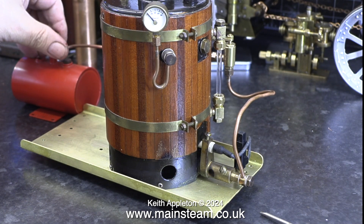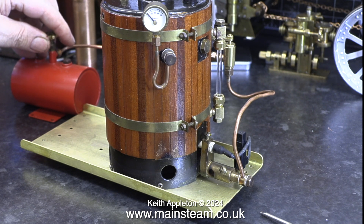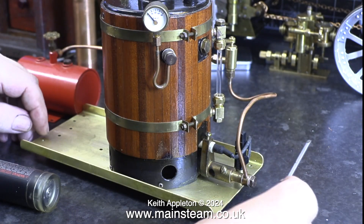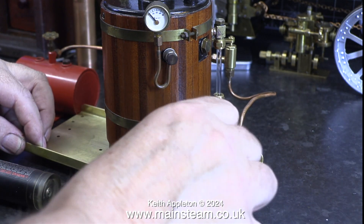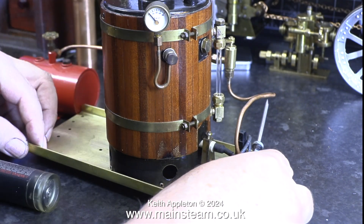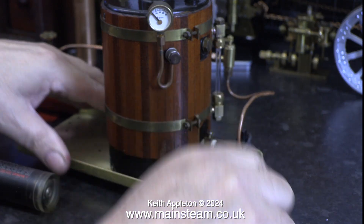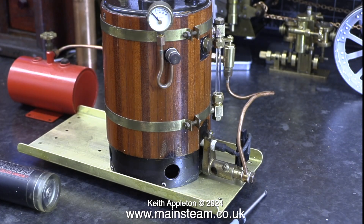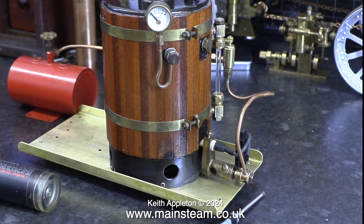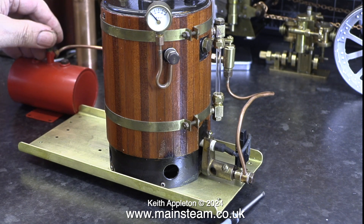What I need to do now is set the position of the gas jet to optimum. This is quite simple to do and you just require your nose — once the foul smell stops emanating from the chimney when the gas is lit, you know that your gas jet is in the right place. It needs to smell clean and fresh, not really horrible. I found the optimum position for the gas jet in the Venturi, marked it with a felt-tip pen, and tightened it in place using the screw.